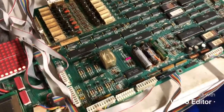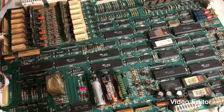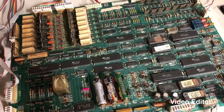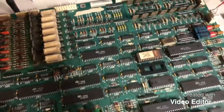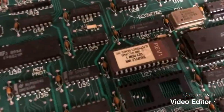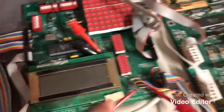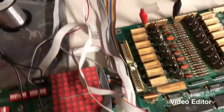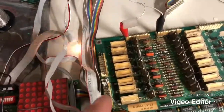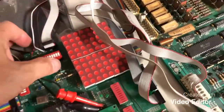Let's test out the whole board — we're using F14 ROMs. Next thing is to put the original Shuffle Bowler ROM back in. This is the second part of the board test. We've now put the Shuffle Bowler ROMs back in, and now the display will not work, so we're going to have to do this blind. We're going to boot up, and we have also substituted an actual lamp for the lamp matrix so that it's a more representative test.